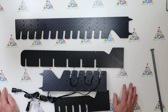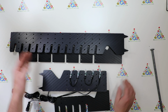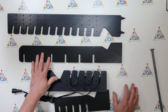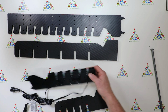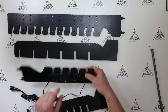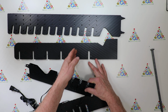All right, now another key difference here is the angle of those pixels. So you can see that these pixel angles are drastically different. So this is horizontal. Now that would be great if your audience is approximately 1 to 3 feet tall. Now we're guessing that the vast majority of your audience may be a little taller than that, or maybe in a car up in the air and may be wanting to view the pixels as bright as possible at their viewing angle. And because all pixel nodes are brightest when viewed directly on instead of off angle, by shifting them and pointing them directly to the eyeballs of your viewer, you have a better, brighter product than something that is going purely horizontal.